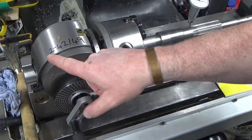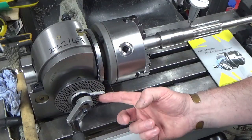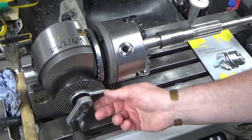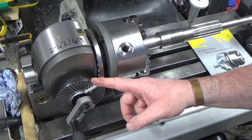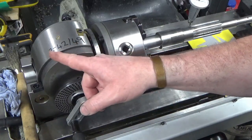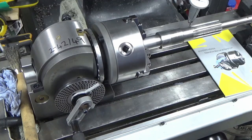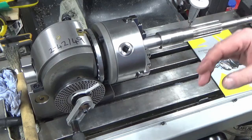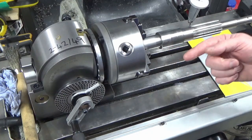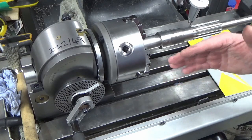I've marked that up on the top of my dividing head so that I don't forget, because I've still my sector arms to set. So when we're ready to go, I'm going to set these sector arms up for my 42 49ths. But you can see there I've got 2 full turns and 42 49ths. So all set up. I'll bring you in at the clock now, at the DTI, and show you the concentricity and setup that I've got parallelism wise to the axis.